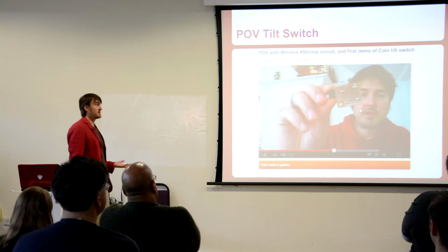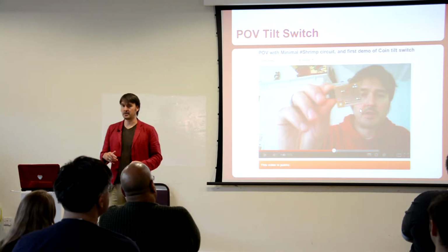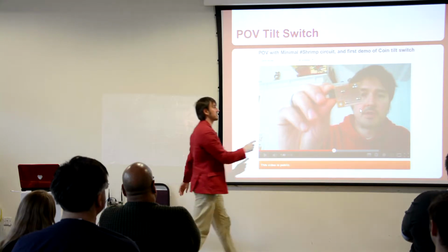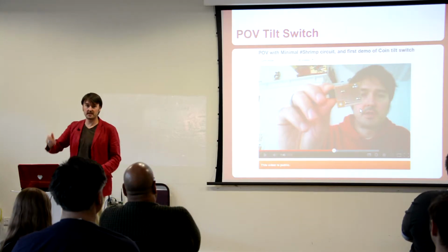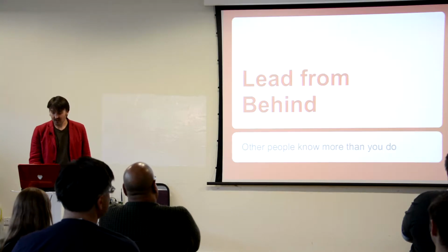And stuff like this, which is almost not documented at all, right? Get a coin, put it in Coke, cleans it off nicely, then solder it between 2 pieces of stripboard, and then you can control the pull-up resistors in software here, and make 4 buttons, so you can build your own tilt switch for 1 penny plus stripboard.